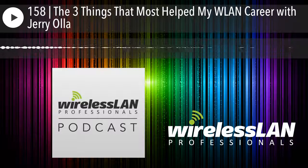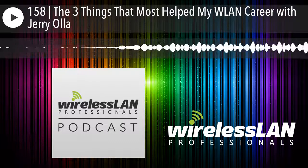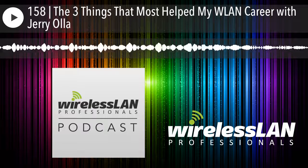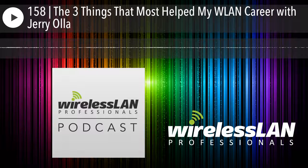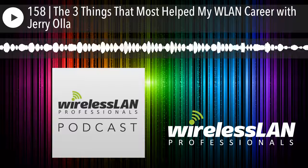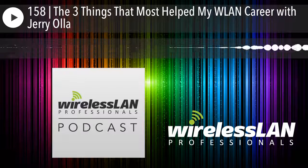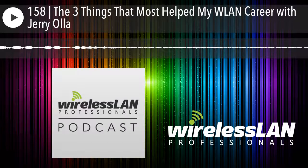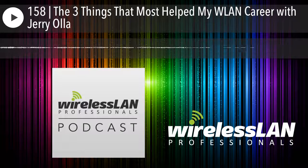In our world and in the connectors we use, male and female is more about what the inside pin is doing rather than what the outside is doing. Sometimes the outside looks female but it's actually male on the inside, or vice versa. We'll call them either jacks or plugs, and you'll have a pin that's male or female. We gave you pictures of all these so when you're shopping or reviewing hardware on site, you can quickly take a look. If there's any other resource you'd like added, just let us know and we'll add it to the next version of the notebook.